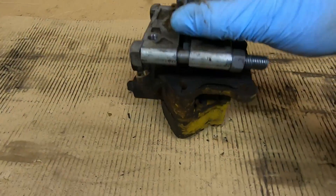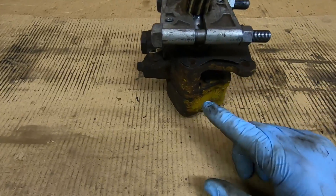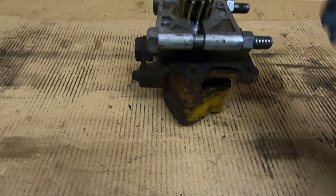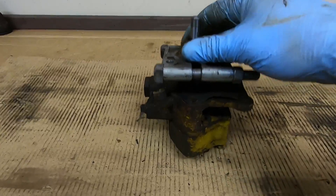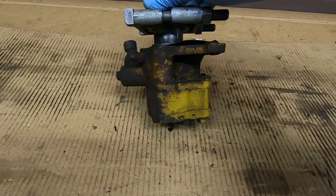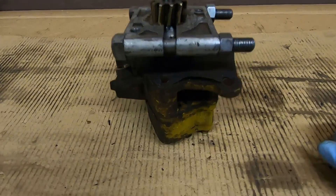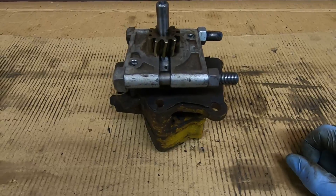I did some research in the parts book and learned that tractors 5J number one through 5J 1676 used this style pump that has the intricately cast lower portion. So this is more of that first-generation tech that 1113 has retained, which makes it kind of cool. It's got a slightly different relief valve, but I'm hoping everything in here ends up being good because I don't have any more spares. Other than those few minor differences, layout, construction, disassembly, and assembly are all going to be the same as the later ones.